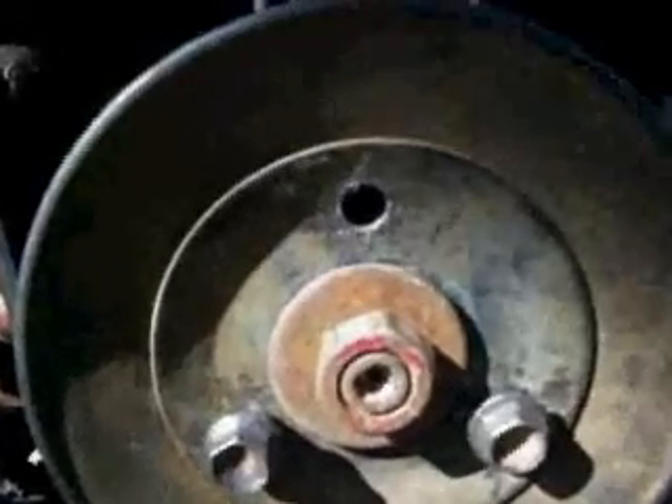The lower pulley, if you can't read it, is off of a rear-wheel drive Cadillac, and the part number is 10055881, GM part number. We've taken the water pump pulley and cut the single V-groove flanges right off there, and that's what you're left with.